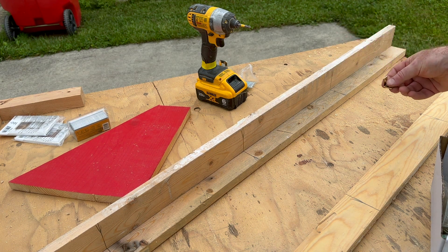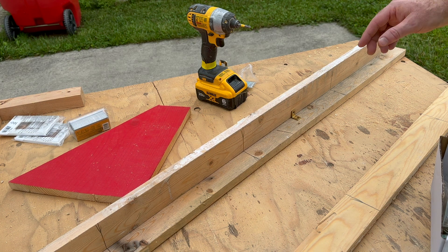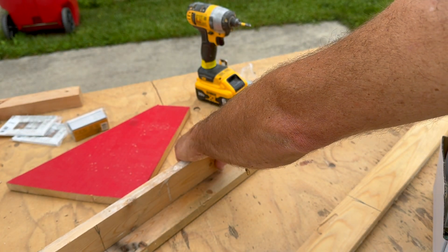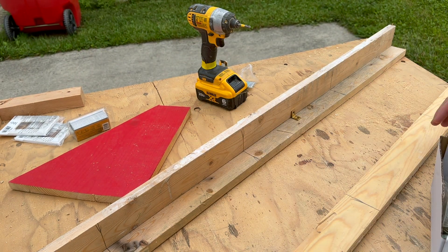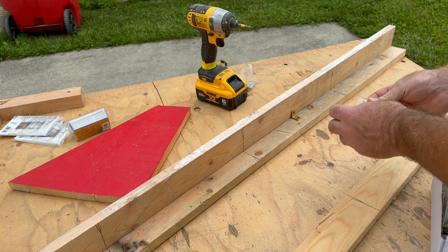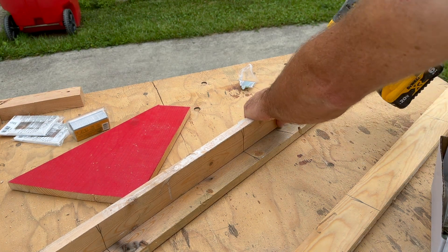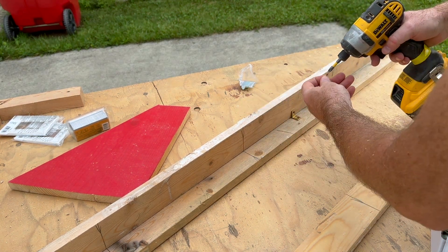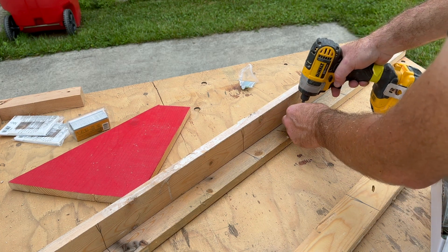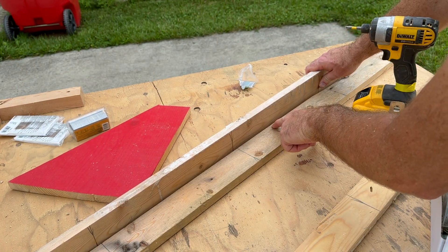To make things simple, I'm just going to use these little L brackets and run a couple of wood screws in. That'll hold this together in a nice L shape. We'll do the other one the opposite way, putting the board down below. That'll give a slightly lower lip in the front of the laying box, allowing the chickens to get in and out easily but providing a nice space in the middle for nesting material. These L brackets are about 50 cents apiece — a very cost-effective way to assemble things. This also saves me from potentially splitting the wood if I were to try to run screws through the very edges of these boards, since we're using one-by material and running a screw through the edge is a really great way to split it.